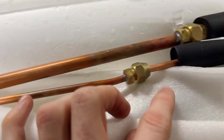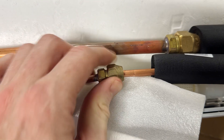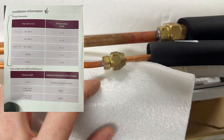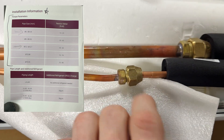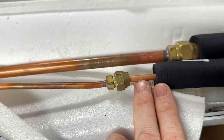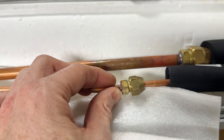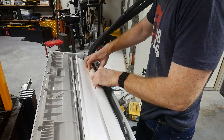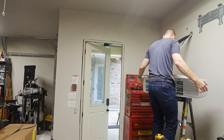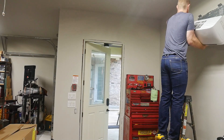A couple of notes about the 6mm copper connection: I don't love that it isn't perfectly square and comes out at a slight angle, but I feel I did everything right so I'm going to leave it. I torqued it to about 12 Nm — the manual calls for much more, but I feel like I'll break something going further, so I'll leave it at 12 and see if there's a leak later. This is a precarious part of the project forced by the left-side hole. I carefully moved the air handler with the connected lines towards the wall and hoisted it up onto the mount, being very delicate since the 6mm line can easily be kinked. I had a ladder outside accepting some of the weight of the lines to help prevent kinking.